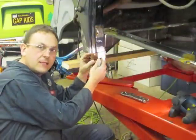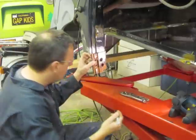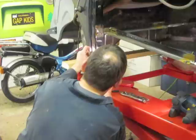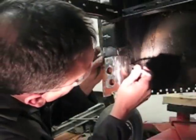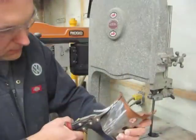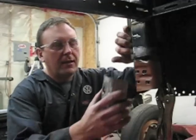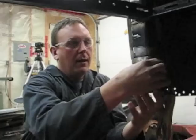I'm now going to mock the outer sheet metal piece into place and use a sharpie to mark any final adjustments that need to be trimmed before we weld this in place. In the case of a door pillar it needs to be absolutely in line — you don't want to have a wrinkle or a bubble here. So I'm going to piece my sheet metal back into the place allotted for it and as a last check I'm going to take a regular framing square like this.